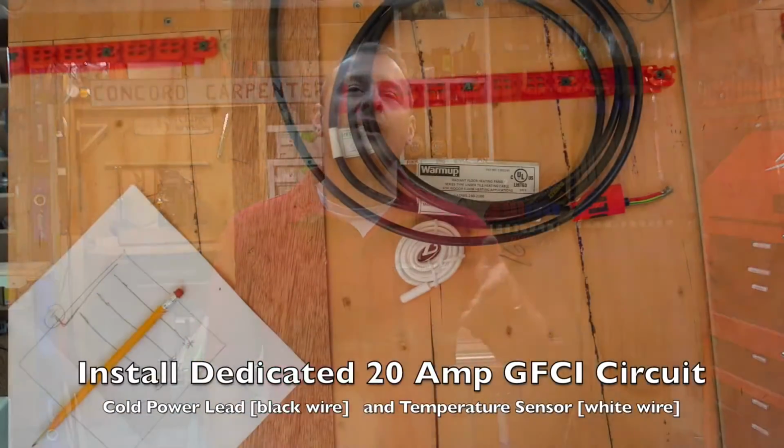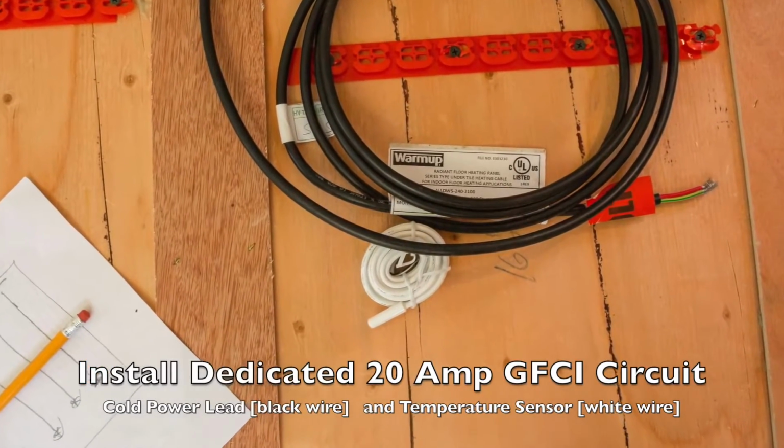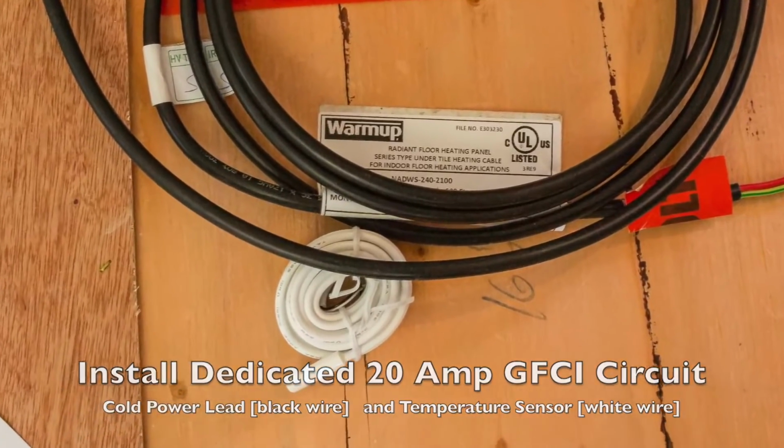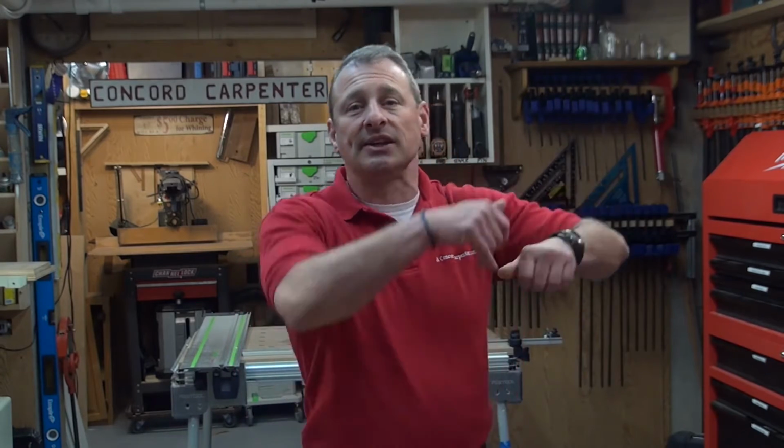Step number 3 is you want to run a GFCI circuit, 20 amp dedicated circuit to your thermostat location. And prior to closing any walls, I always install a wire pull string from the thermostat box all the way down to the shoe plate. I usually cut a little notch out of the shoe plate, the 2x4 plate at the bottom of the wall, so that I can easily fish up or pull up my wires.